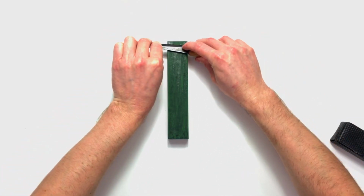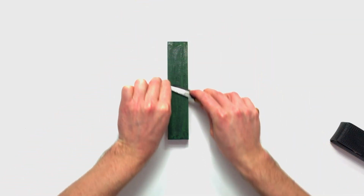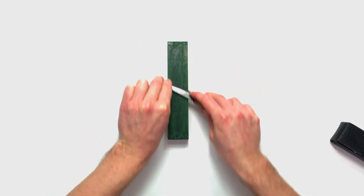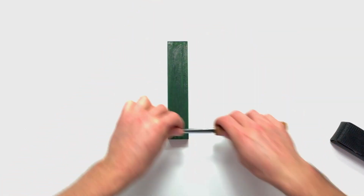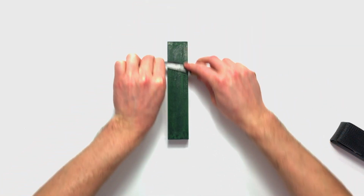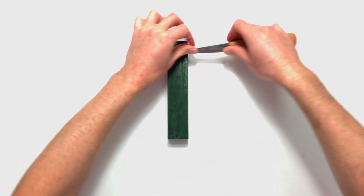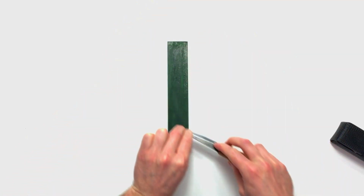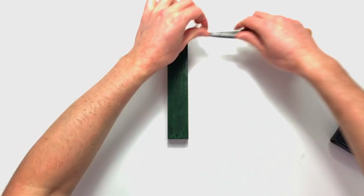And when you've sharpened a blade, you want to do about 50 passes or so. That ensures you've removed the burr and you've taken this compound from a fairly coarse grit to start with at around about the 8,000 grit, and we've abraded it down to around about the 60,000 grit. And that's what we're looking at doing. Do 50 or so passes. I'll try and do them quickly. I want to keep this all in one take so you see there's no trickery, there's nothing going on. I'm not clearing up any mess. It's literally from start to finish, and yeah, you can't really go wrong.